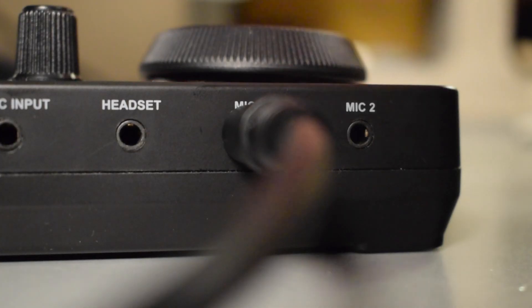As far as podcasting goes, that's all we have to do with the actual Monocaster itself. If you do want to connect a second microphone, you can use the second mic input, but keep in mind that the AM200 does not provide phantom power, so you can only use microphones that do not require phantom power, such as the Mono A03, the PM360, the PM325, and of course dynamic microphones.